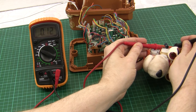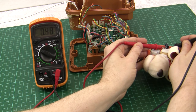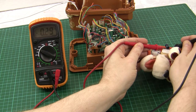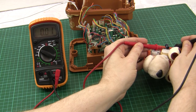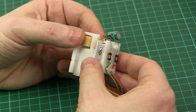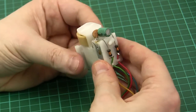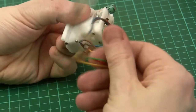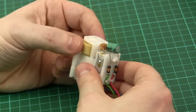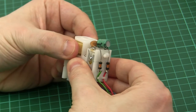If you look at the reading on the voltmeter, this is the voltage being applied to the top jaw motor, and you'll notice that as Teddy is speaking it rapidly switches between being a positive number and a negative number, because this motor can be driven in both directions. You may have seen this servo before from part two of my Teddy Ruxpin refurb videos — it was the top jaw servo and was eventually replaced.